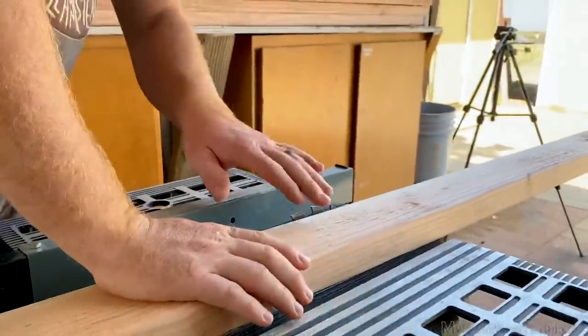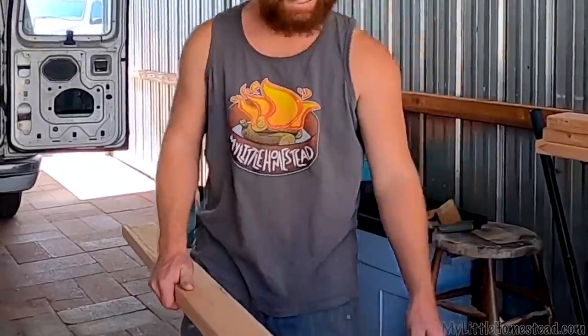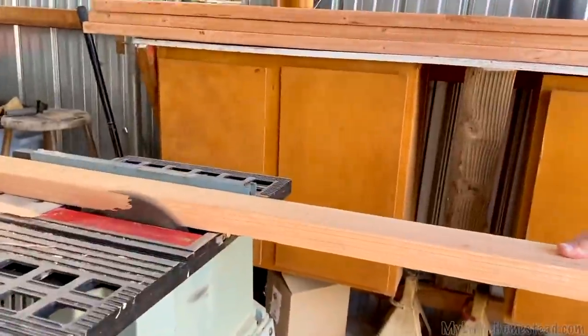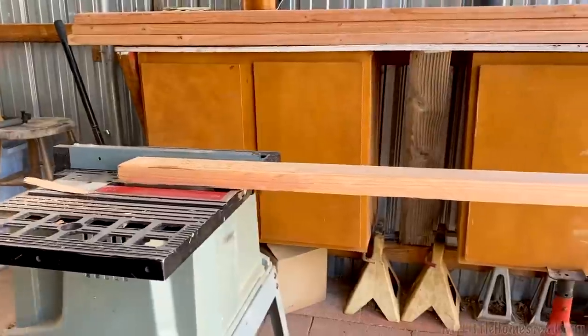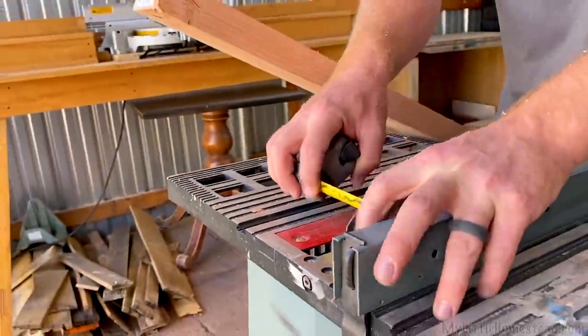We're taking 2x4s and ripping them down into the trim size that we need, because it's a little more cost effective to do it like that. Plus, then we can really decide what sizes we want our trim to be. Okay. Next.